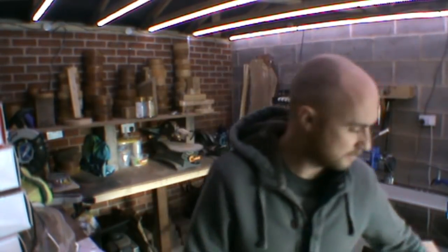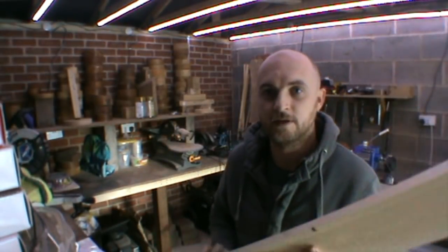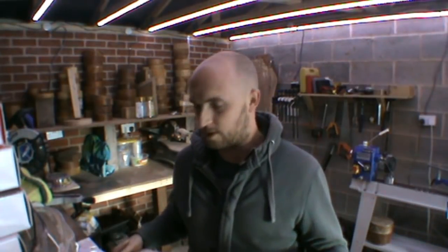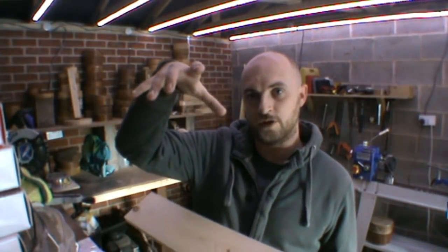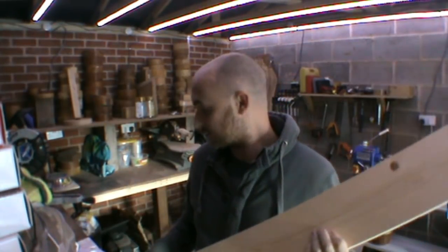Next up is going to be the frame. So got another sheet of just construction timber, which I'm going to buzz off and then put a step in with the table saw, so that the table top will just slot right in like the back of a picture frame. So fingers crossed that turns out okay. Might be quite a few recuts, but we'll just buzz this through the table saw and get this started and then start taking some measurements.